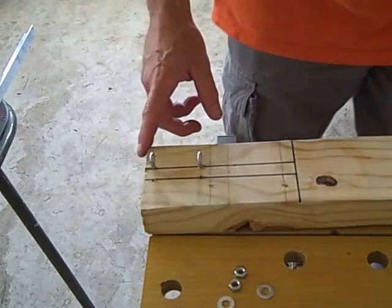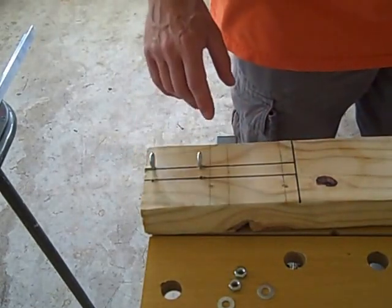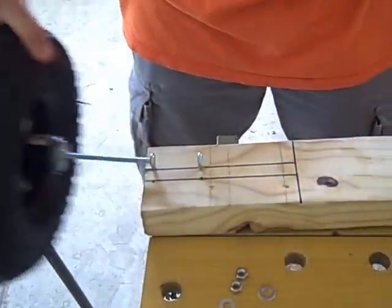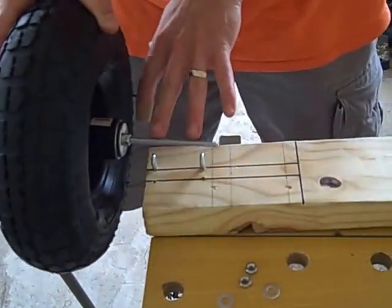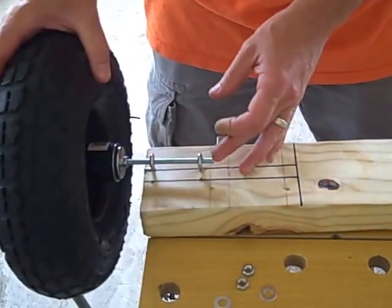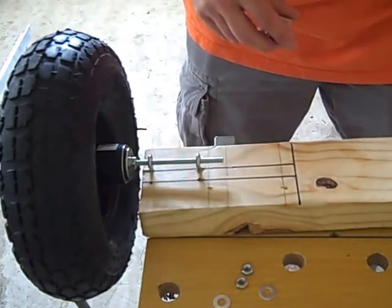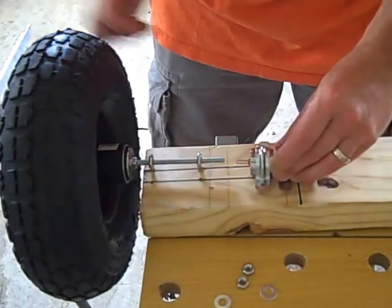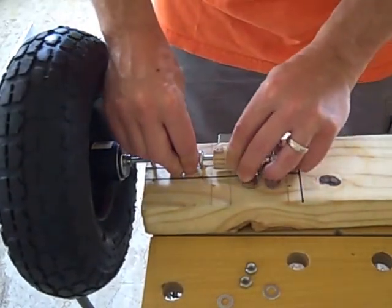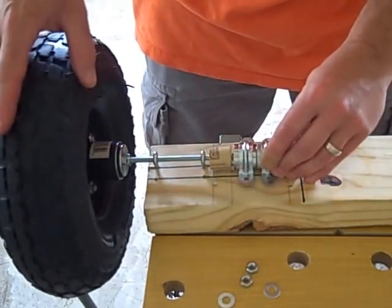The robot's width is going to be 12 inches, so this represents 6 inches — each side will need that 6-inch space to work with. Using these eye bolts to hold the weight of the wheel, I would use these bolts and washers to hold the wheel in place, with the bolt positioned so the wheel can't move side to side. Then I would take the DC motor and, using conduit straps, strap that down and couple it to the wheel using that coupler.